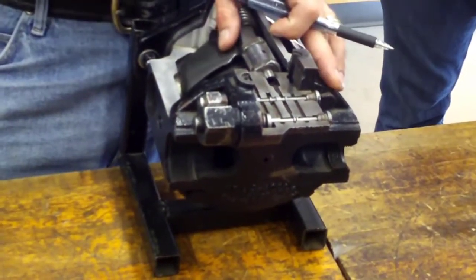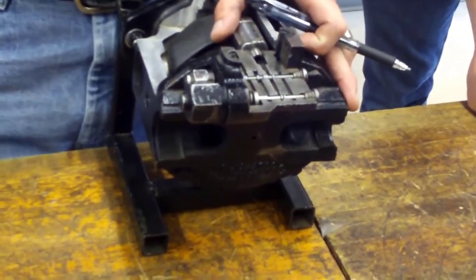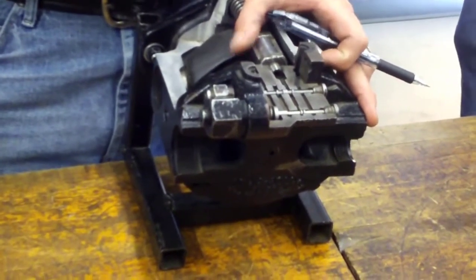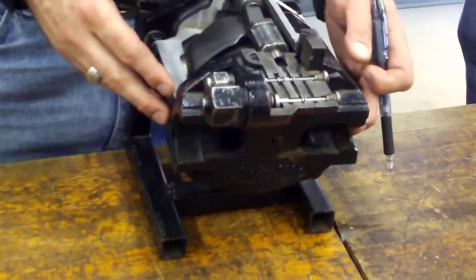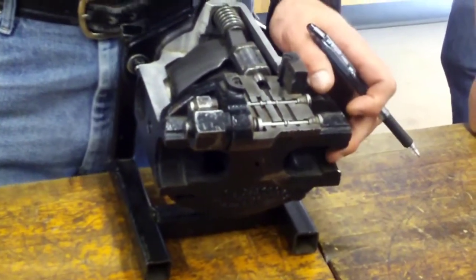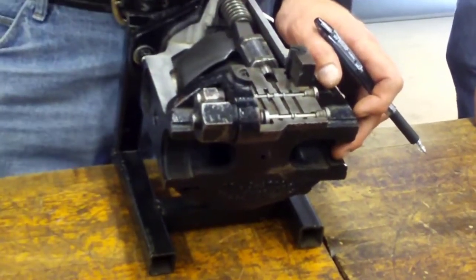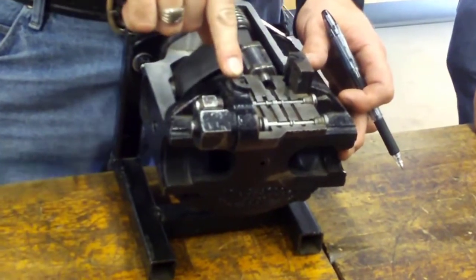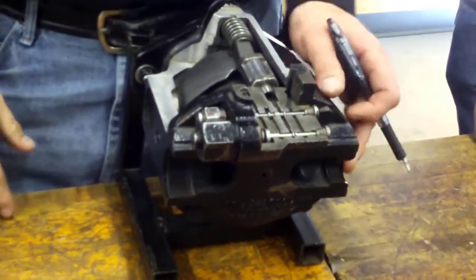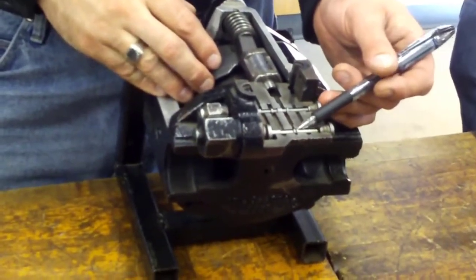Now let's imagine that 1,000 psi load was a cylinder, and that cylinder is dead-ended. The pressure is going to start skyrocketing. As that cylinder dead-ends, pump output pressure starts to rise, and that feeds through to the work port, which comes back to the load sense line — so this keeps demanding 350 psi more. This could just spiral out of control and blow the system up, so rather than have that happen, we have a second spool that can override.